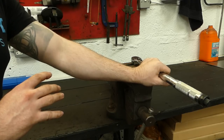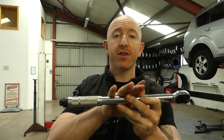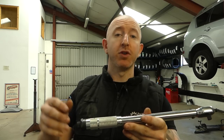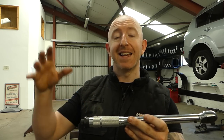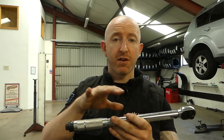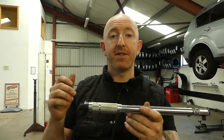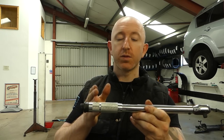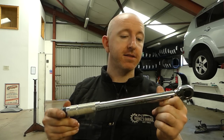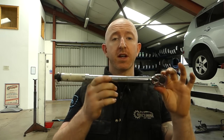If you have a bigger torque wrench you'll need to do a few calculations. I'll link in the description the video I found on how to do this — he demonstrates a larger torque wrench and a conversion table, and it's very easy and accurate. I went with 12 inches on this one because that means there are no extra calculations needed. This is a really quick, simple, and cheap way to calibrate or check your torque wrench.